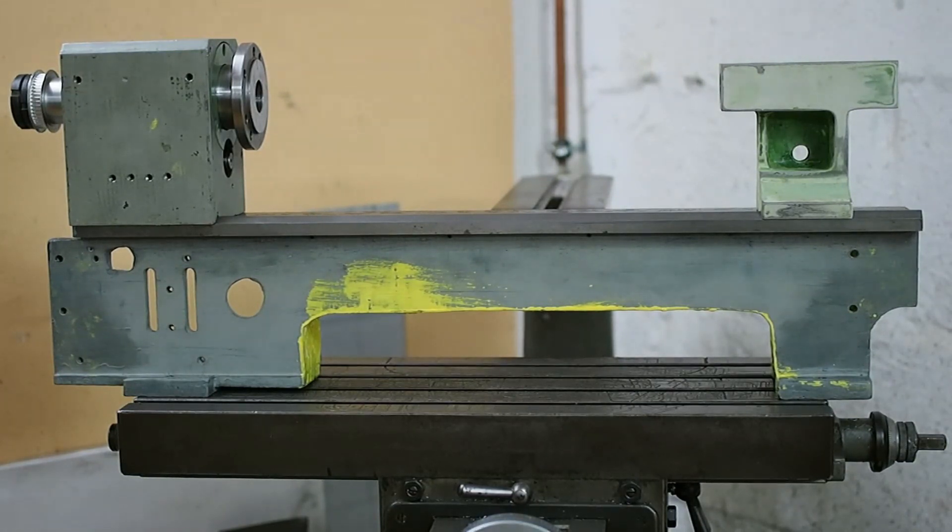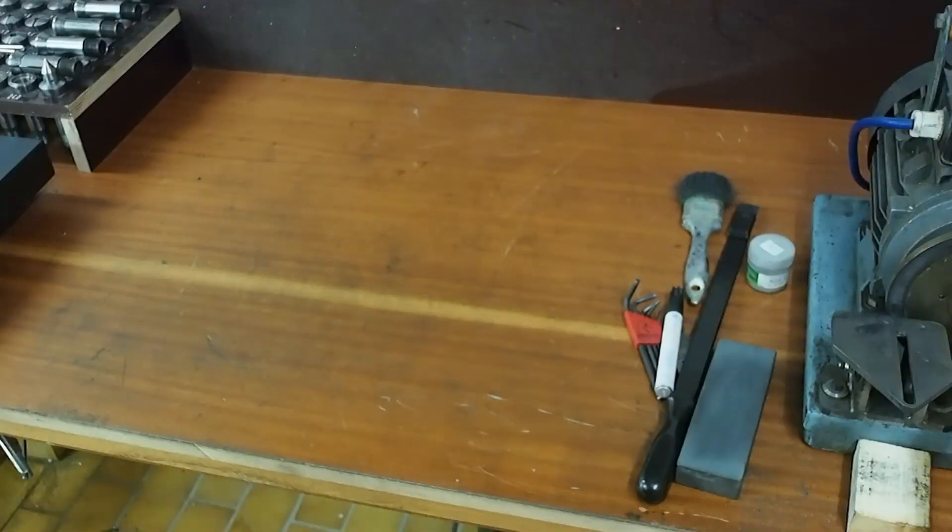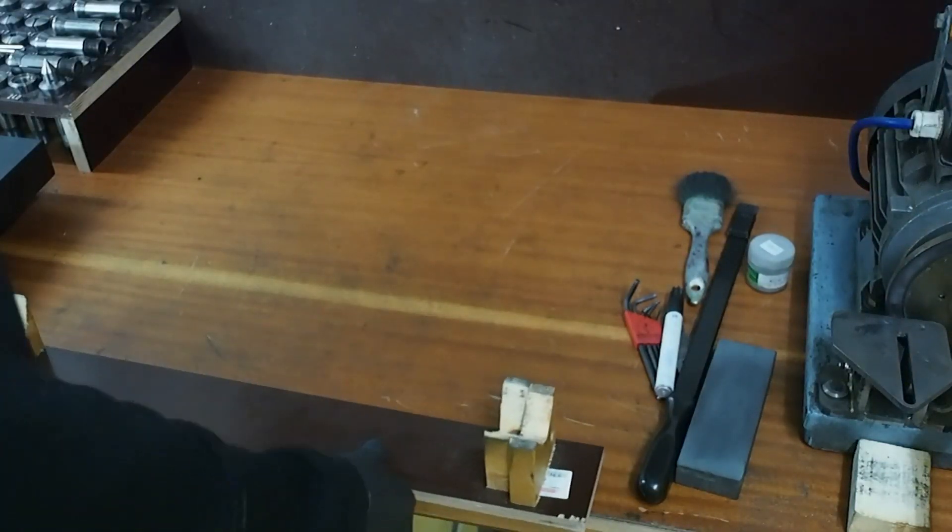I already paint stripped it and just put a thin layer of undercoat on it. I figured I'd basically start at the bottom. So the first thing I did was scrape in the feet, try and get a level surface. It serves as a basis for everything else. So let's run down that rabbit hole of scraping, shall we?